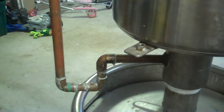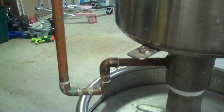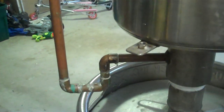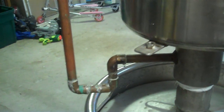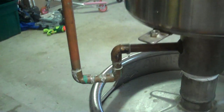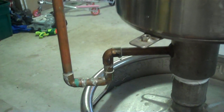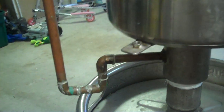And so there's a trap in the bottom of the drain, and that needs to be primed before your run. I usually forget, so I usually just stroke it down with some ice, get the vapor to condense. It's trying to bypass the bubble cap, get it to condense, and fill this with water by virtue of just condensing the vapor that's in it. It condenses down pretty quickly, and you can tell right away when the vapor stops rising, because this section here cools off pretty quickly. So that's the first piece.